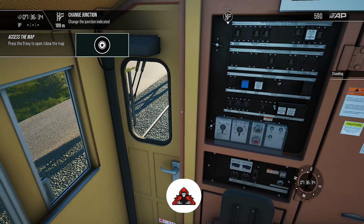Before proceeding, check the two couplers are in the right position to allow for automatic coupling. Look at the rear coupler on your train and ensure it's open. Operate the cut bar if it is closed to release it. Next, walk over to the freight cars you're going to couple to and check their coupler knuckle is open too. Operate the cut bar here to open the knuckle. Before coupling cars, always check the knuckles are open, or you'll just bounce right off.